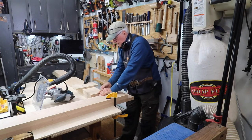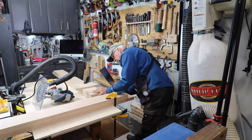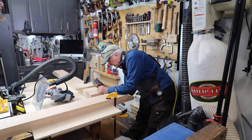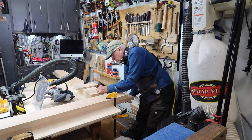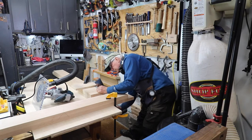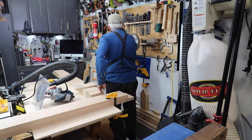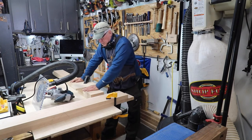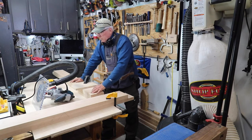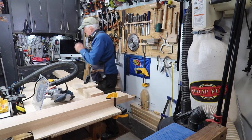You're always going to be concerned about blowout when reaching the edge. To protect against that, you want to break the fibers along the edge, so I need to get a nice straight cut. I want to be a little bit inside of that line when setting up. A light pull to get it started, then check to see I'm inside of my line. That exercise was to avoid tear-out — you need to do something to deal with tear-out, although with maple it doesn't seem to be as much of a problem as with red oak. Alright, I got my line set, stop block set, all this stuff ready. Let's get my safety gear on.